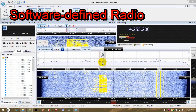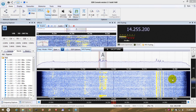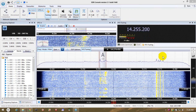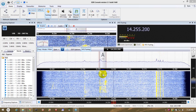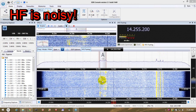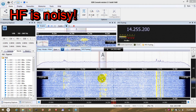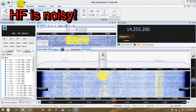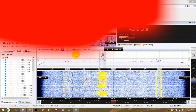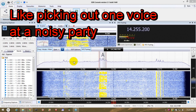You're looking at the screen of a software-defined radio, and over 40 kHz of signal is spread out before you. The part that is tuned in is shown in the middle as the A receiver. The waterfall shows a record of the signal as it comes in. The wiggly line in the middle is a real-time spectrum. One of the first things to note is that there is noise on the signal. Some signals are stronger than others. Only the strongest signals come to your ear without any noise. The HF bands are noisy, and unlike FM, single sideband is not designed to reduce noise. It's like being at a noisy party and trying to pick out the voice of the person you're talking to. Your ability to do this grows with practice.